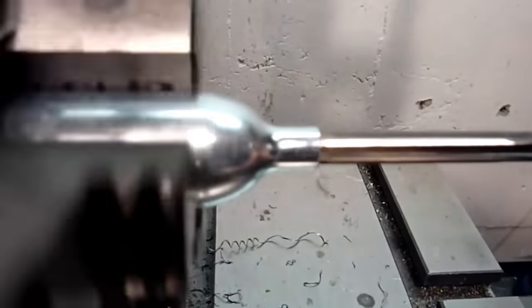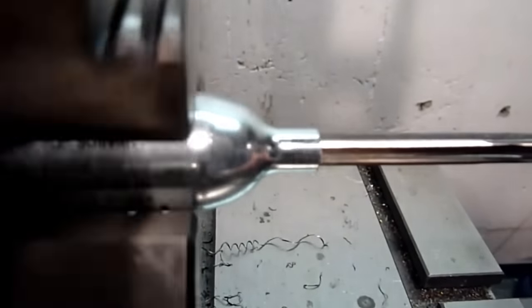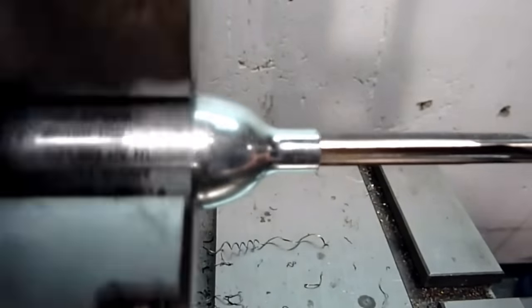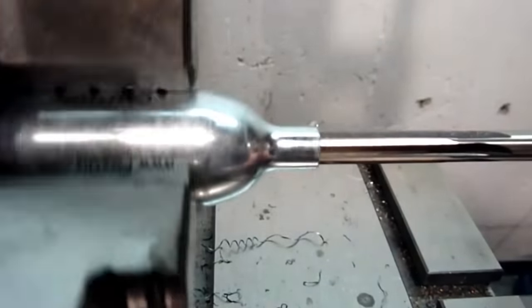To finish with a final polish size, use a quarter-inch straight reamer. If you apply a small amount of side pressure, you will have a minimally oversized hole, and the valve will slip in smoothly.